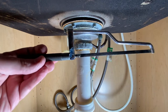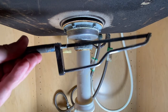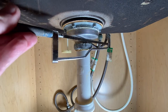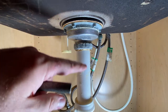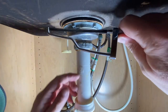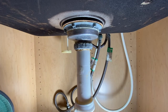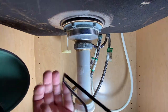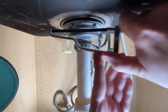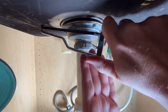I just grabbed a mini hacksaw — they sell them in a bunch of different kinds, I'll put a link below. I like this one because it's a little more solid than some of the others I've used in the past. We're going to get in here right by the threads in the nut and make a cut so we can get a screwdriver underneath it and break it out. Make sure you have some safety glasses on. This blade was super dull so I grabbed a new blade.